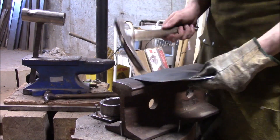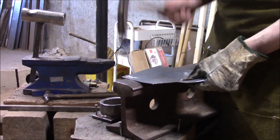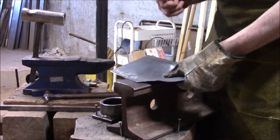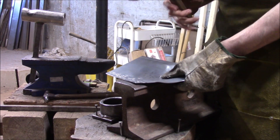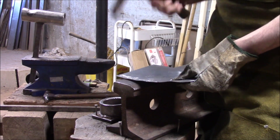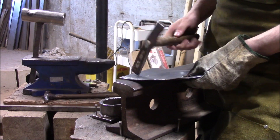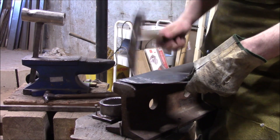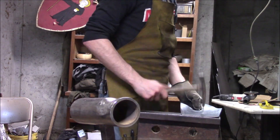After that, I put it onto a little anvil and use a cross-peen hammer with a pretty aggressive strike to really start putting in a curve in those places where you didn't get with the dishing. This is a slow process, it takes a long time, and your arm will probably get tired, but it provides a consistent curve that makes it easier to polish in the end.